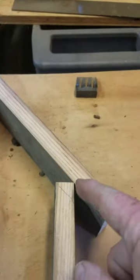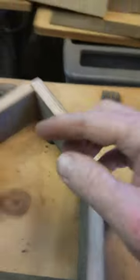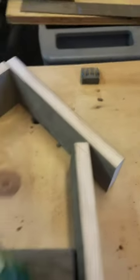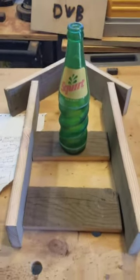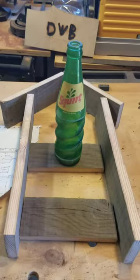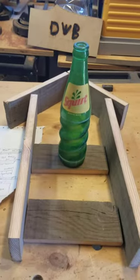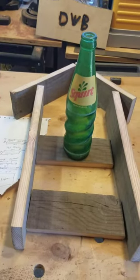You'll notice how these joints come together — that's not a very good joint. So I'm going to miter this so that the board fits right up against the end on both sides, so that when I staple it with the staple gun, I'll have something to staple down into rather than trying to hit that little tiny corner. We're almost to the point where we can start assembly, and when we get there it's going to go really fast. You'll have yourself a marvelous bird feeder you'll be very proud of for a long time.